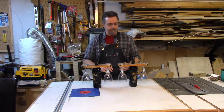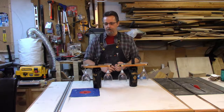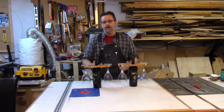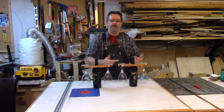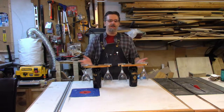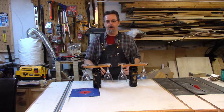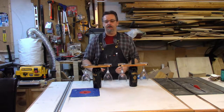So here we are, we're all done. I had considered other finishing options besides BLO paste wax. There's the water-based poly, but that kind of feels plastic-y and I wanted this to have a good hand feel. There's also shellac — I really like shellac as a finish, but we're using it around alcohol, and alcohol is the base solvent for shellac, so if you spill some on it you risk ruining the finish. These are going away to people and I won't have easy access to fix them, so I figured BLO paste wax was the easiest, best way to go. It has a nice hand feel, looks really nice, and it's easy to fix if needed.